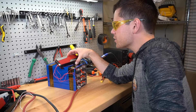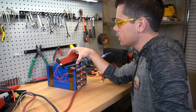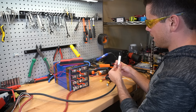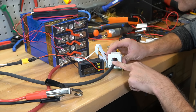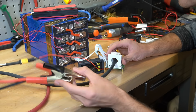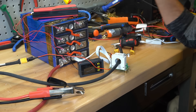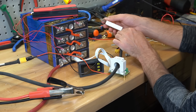These are our inverter cables so we can charge and discharge this battery. This BMS can pull 100 amps, and at 12 volts that's 1200 watts, so we can easily power up a pretty big load with this. We're going to lead by example and charge up the capacitors on this inverter. We have to add a hall effect sensor — all right, the hall effect sensor is in. These are the inverter and charger cables going to the battery so the hall effect sensor has power.